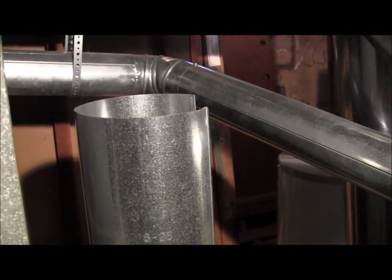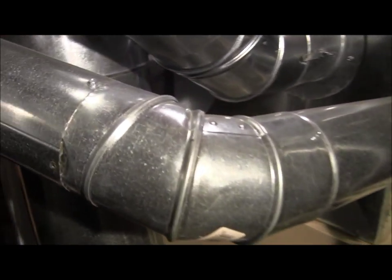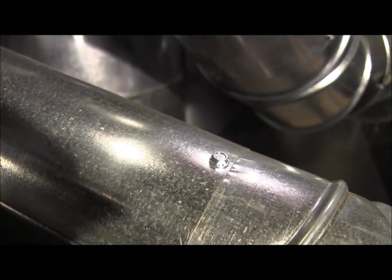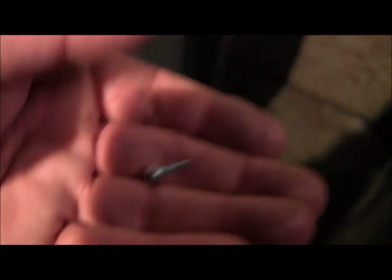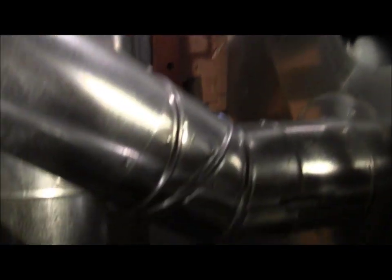It's not real heavy. You don't weld it together. It's actually held together with Tek screws. And if you look right here, there you go. There's one of your Tek screws. They're self-drilling, and I just blast them in with a little Hilti gun. That's all it is, a little guy like that. Got a real sharp point on it. They zip right in. You have to be able to take the connections apart. That's the reason that we go to the trouble to do this.